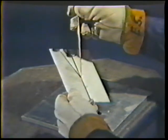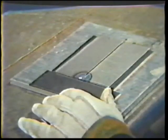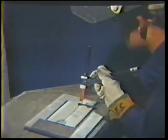Realign the joint for a 1/8 inch root opening, since the tack weld causes the joint to shrink slightly. Now use two pieces of 16 gauge steel to shim the workpiece off the table and allow full penetration. The tack weld should be to the left. Place an additional plate at the end of the joint to prevent the escape of shielding gas. Position yourself so that you can deposit the weld in a comfortable manner. Deposit the first pass with a 90 degree work angle and a 10 to 20 degree push travel angle. The filler rod is held over the joint axis at a 20 degree angle. Start the arc and move along the joint with a smooth travel speed.